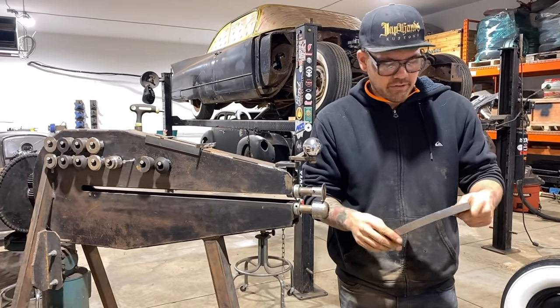I want to keep this nice and straight — pretty good. There's our curved flange; you can see how much shrinking that took. Now let's do the inside one and see how much stretching it will take. Same deal as before — I'm just going to time-lapse it, run it through a bunch of times, jump on the stretcher, and work at it until we get the same result as this side.